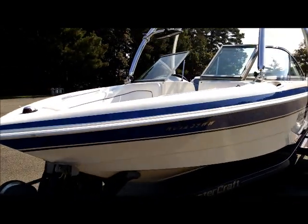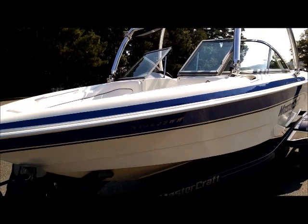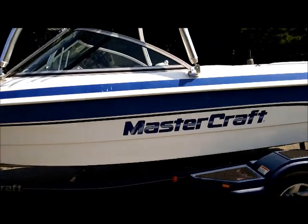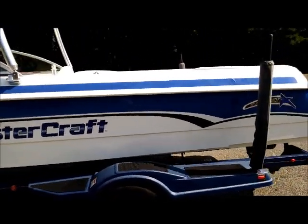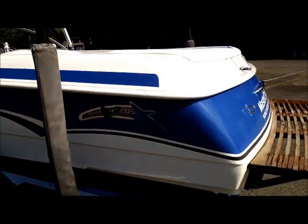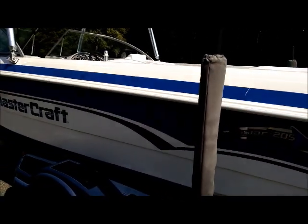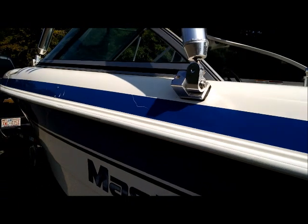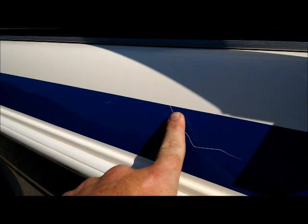Just a real quick look at the outside — it's a 15-year boat. The gel coat looks excellent, and you can even get it to more of a mirror finish by using the Finesse It 2 3M wax product. It's got little scuffs on the rub rail, but nothing major. The rub rail is in good condition. There's a first little scratch in the blue; I've got the blue ordered and I think it'll fill that up easy. You can wet sand it and polish it right in.